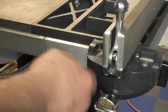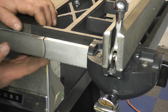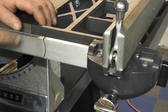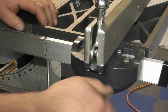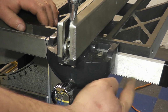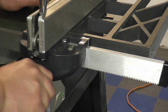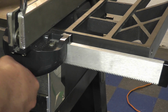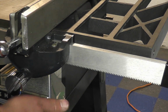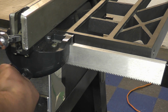This whole side is a little bit tighter, but I can feel it. If you look at the actual finish, this one and this one is a little less. So I could probably just polish or round an edge on these little teeth on this side, and that'll probably take care of that. But it definitely locks down good. So we're going to actually run an indicator on this fence and see how off it is.